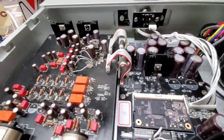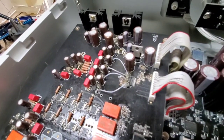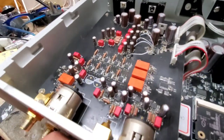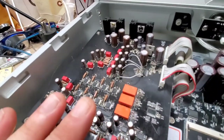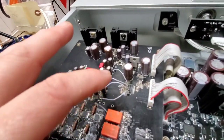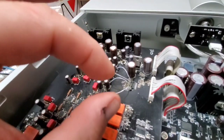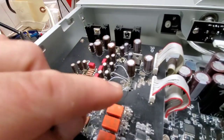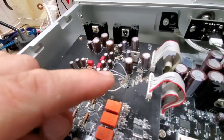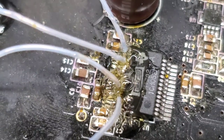And we come over here — it's a chip-based design, that's a Burr Brown chip. And there are two boards — see the one below it. So this is dual mono: one DAC board and analog board per channel. These little wires that go out there — you can move them and moving them changes the signal-to-noise. So they get these perfectly dialed in. They could have done traces, but they tried flying wires and it sounded better with better signal-to-noise, so they went with flying wires. Nobody does that.